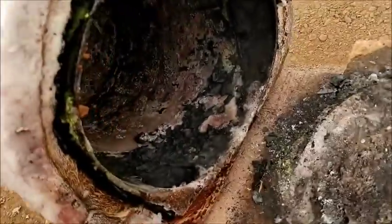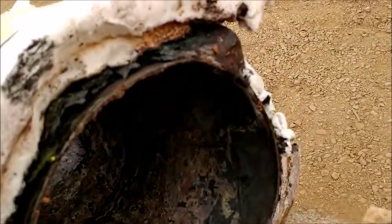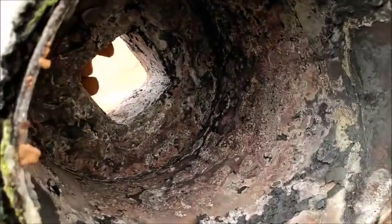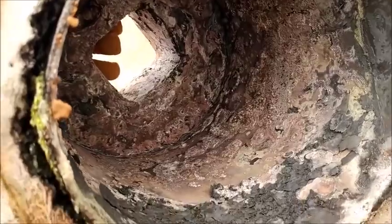And underneath, it's an 8-inch piece of stainless steel pipe. There's one, and there's another one on the other side, tangential inlets for the propane, a cap plate, and then a 3-inch square tube for the exhaust.